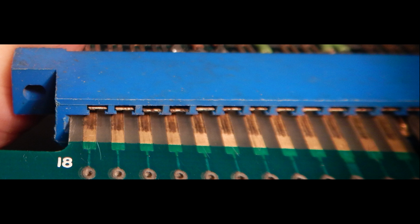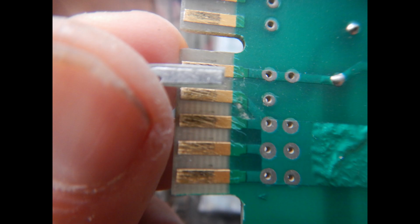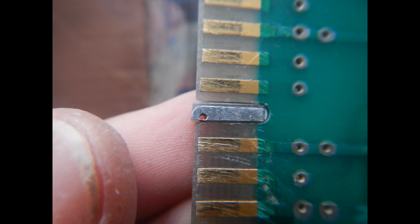Finally, it's time to wire an interface connector for power supply and all other needed signals. However, the PCB edge sides were kept too narrow and the connector can easily be mated shifted enough to have the fingers contact between the pads. So I cut an edge connector pad from a donor board that I kept for spare parts. Then I sanded it on both sides until it fitted nicely on the edge key with the right distance from both the pads next to it.